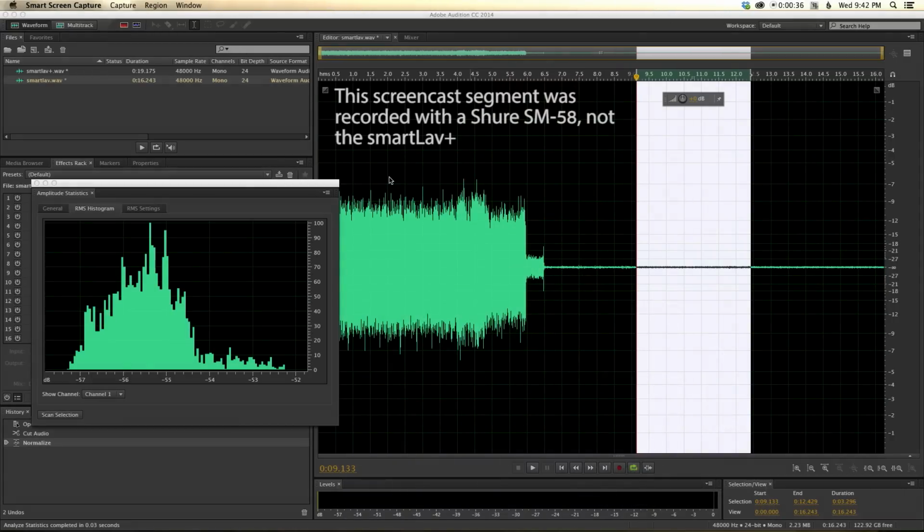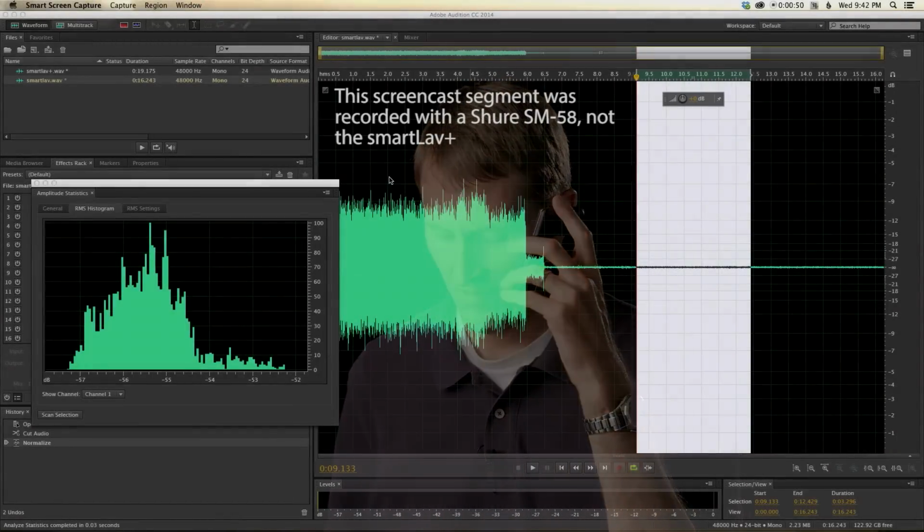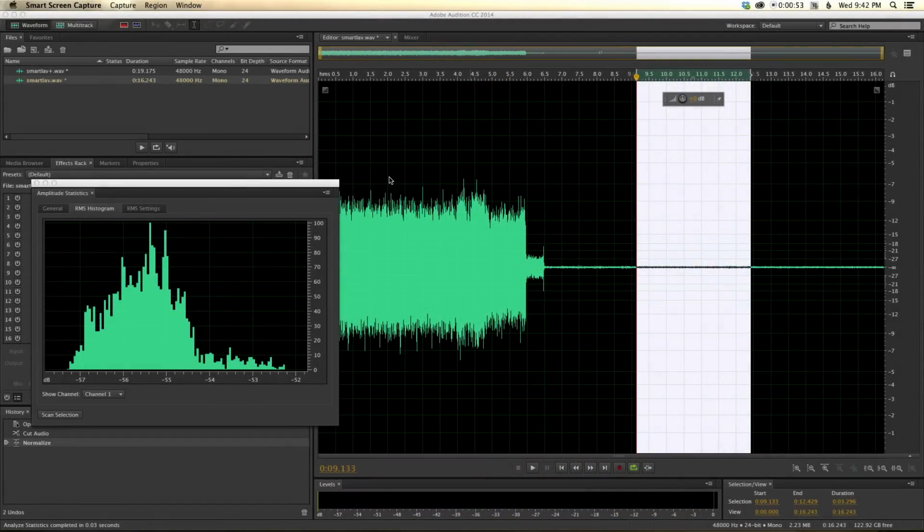So to compare the noise between the two mics, what I did is I recorded using each of the different mics on my iPhone, and then I used a separate phone to actually generate some noise, specifically white noise, with a white noise generator app. And we recorded that, holding it at about my mouth level and wearing the lav mic in the typical spot you would normally wear a lav mic, just down on the chest. And we gathered those both with the Rode Rec app. In the Rode Rec app, I had the input level set to 2/3. There actually aren't numbers, but I just left it at the same default level, which is about 2/3 gain.